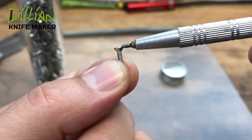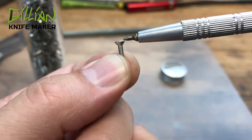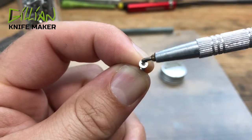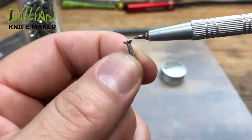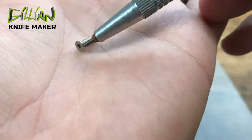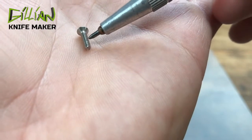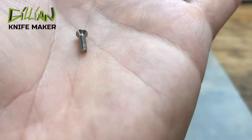These also have an 82-degree beveled head — this angle right here is 82 degrees, so you get an 82-degree tool to put this countersink in your handles. These are a Torx style driver; it requires a T6 Torx. I was taught that to have the full strength of this tiny little screw, you need the depth of the threads to at least be as deep as the diameter of your screw. The typical diameter of this 2x56 screw is about 86 thousandths.